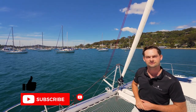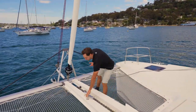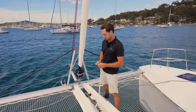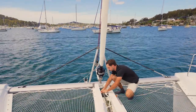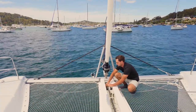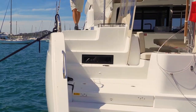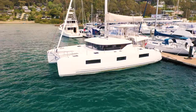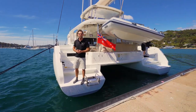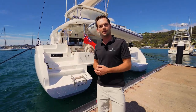I've got about 30 to 40 metres of chain out at this stage. You are still relying on the windlass, which is an electric motor — it can take a lot of weight, but in the event it slips or doesn't hold fast it's useful to add a safety. We use the anchor safety — normally used to prevent unwanted deployment when the anchor is stowed — by extending it as far as possible and putting the shackle through the chain. If the anchor windlass does give way or the wind comes up and pulls too hard, that safety snubber line will catch the boat and prevent it moving further back into the dock. The anchor chain is nice and tight, two stern lines are tight, and I've got about a metre off the back of the boat.